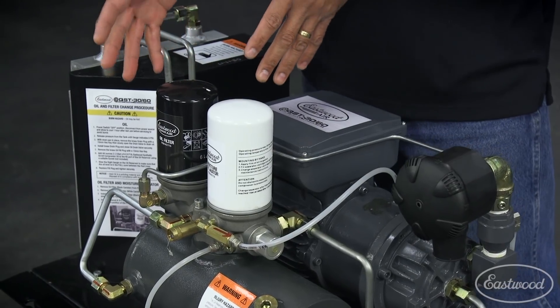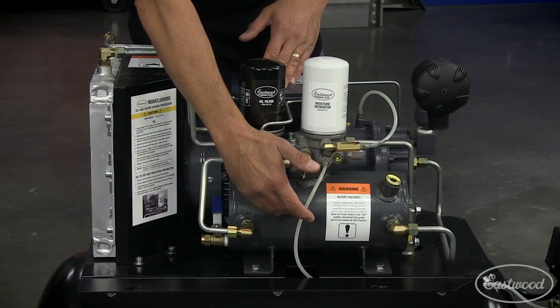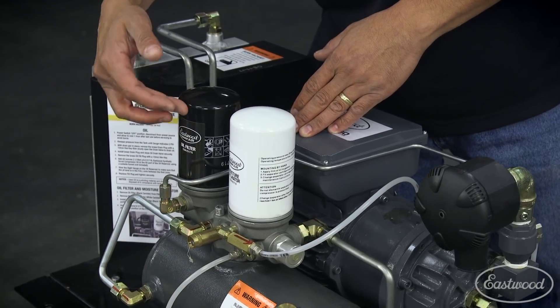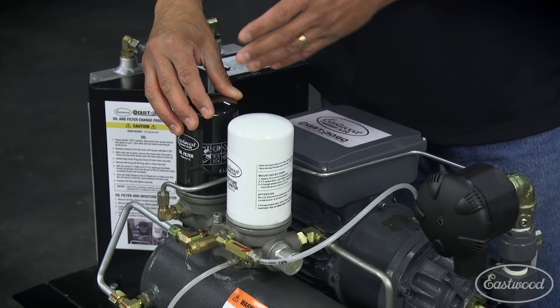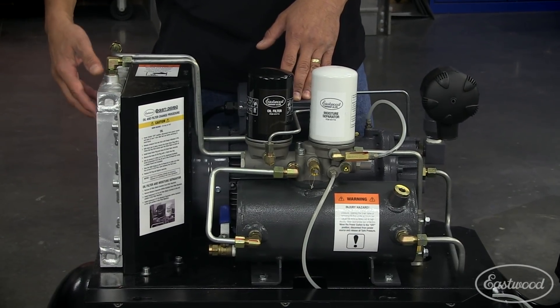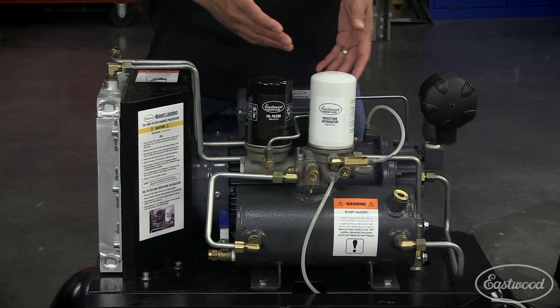The second part of the system is the oil side. This oil unit here contains about 44 ounces of scroll oil. What we do then is we pressurize that, bring it up through a contamination filter to remove any particles or contaminants in the oil, and then through the oil cooler on this side. This then cools the oil charge and brings it back into the oil reservoir itself to be recirculated through the unit. We designed this unit for long life, dependability, and performance.